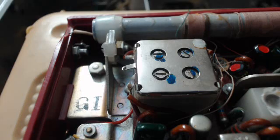Now, the elephant in the room with a lot of these old radios, besides there's really nothing to listen to, is that you have to constantly fix them because of the capacitors from China, the yellow ones, which I use. I notice some of them go shorted. They're just sitting there. You go to turn the radio on, it doesn't work. You troubleshoot back to a yellow capacitor made in China. Now, I was watching a video, and Shango had bags of these things from a guy's estate. And he says, I don't like these capacitors. They just short. And I'm like, there we go.